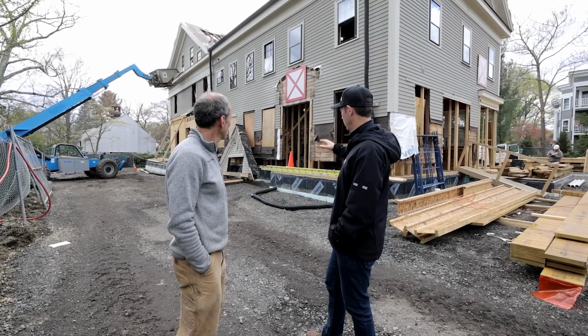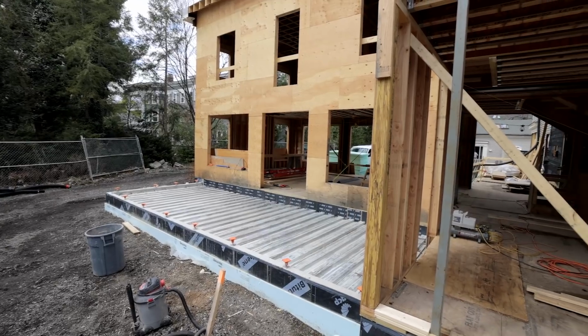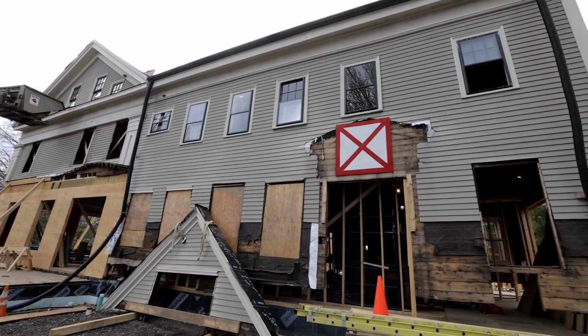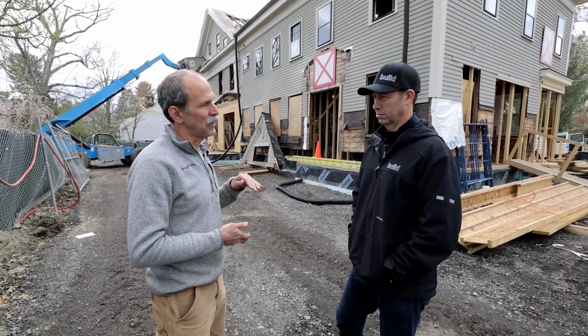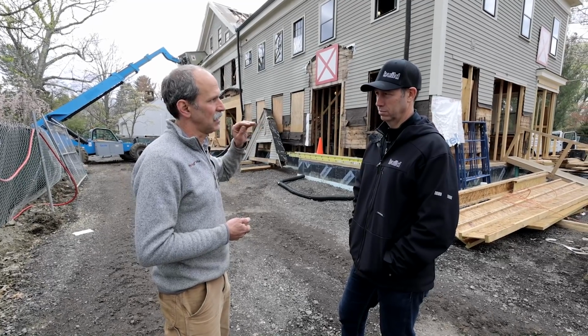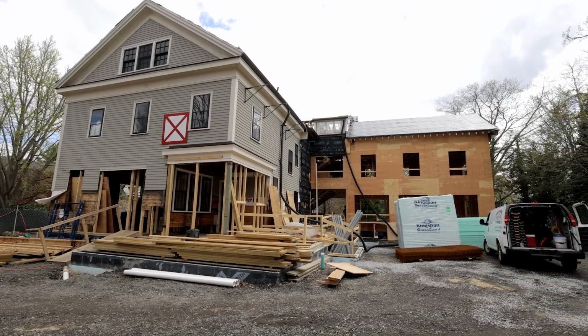All right, Greg, so foundation's in place. It's not like you just drop the house down and you're done, right? No. It looks to me like you cut the ankles off the house here. Yeah, you've got maybe a foot or so missing at the bottom. One of the plan goals was that they wanted to gain some ceiling height in the first floor. But from a zoning standpoint, the house already exceeds the allowable height. But as an existing building, we're allowed to maintain that height.